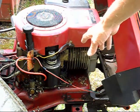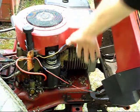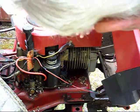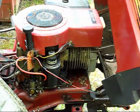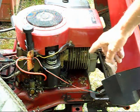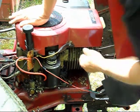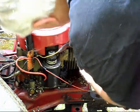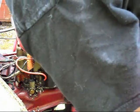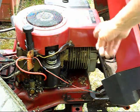You look at your old tractors, your real old ones — all they had was these fins on the engine. They didn't need a cowling to go over that to keep it cool, supposedly. You've got enough cowling here and the fan from this here to cool things down. I ran this thing without the cowling last summer and no problems whatsoever. I'll be damned if I'm going to put the cowling back on here and have it overheat. I've got a lot of mice crap in here, but at least I can get it out.